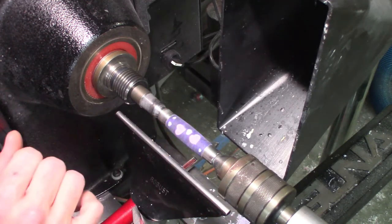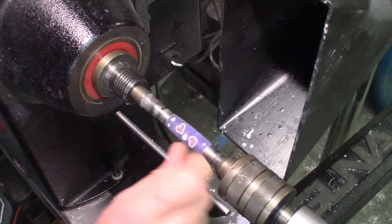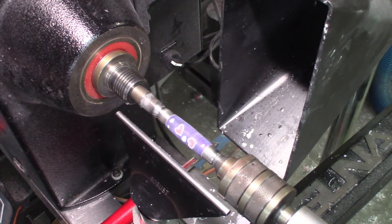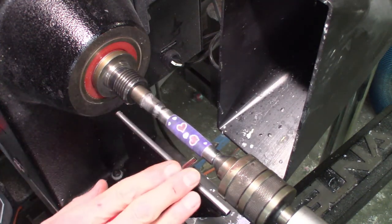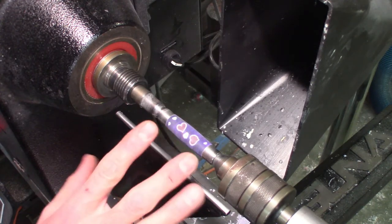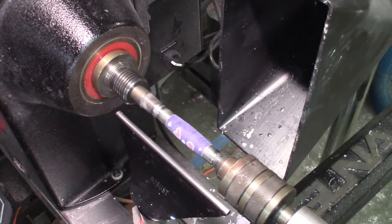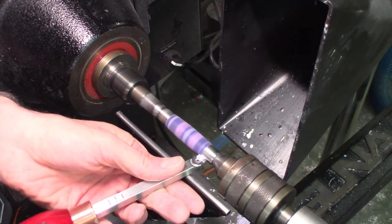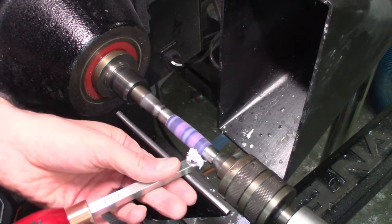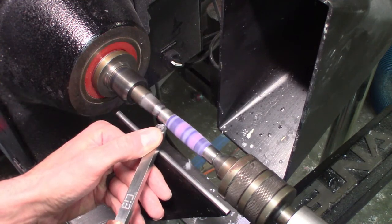But resin printing comes with a lot of drawbacks too. It's really messy and smelly, so it's really not for everybody. The other drawback to resin printing is you're really stuck with very few colors. You can dye it, you can even add mica powder to some extent, but it makes things a lot more difficult with the print settings. You've got to really play with it. So resin printers, I like them, but you're signing up for a little bit more than the FDM style printers.